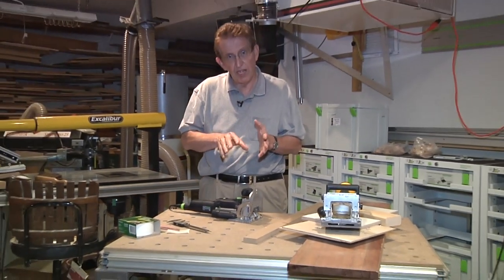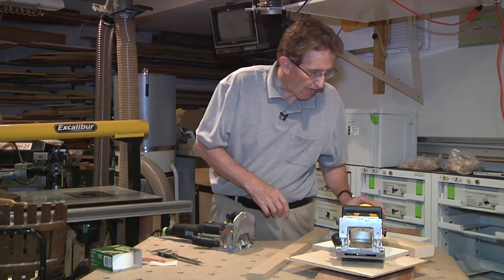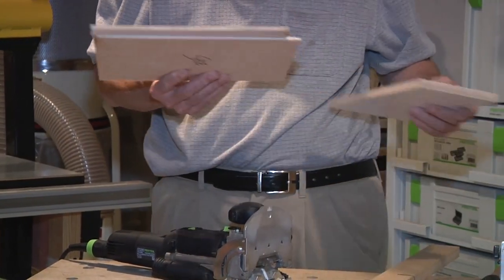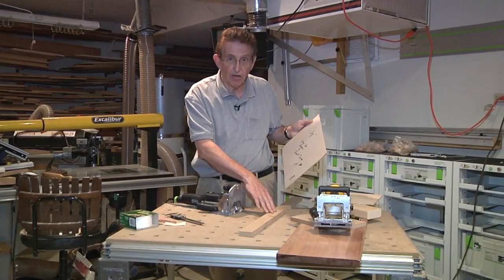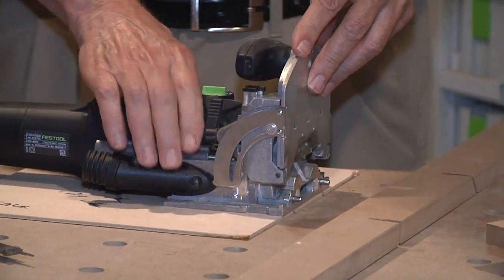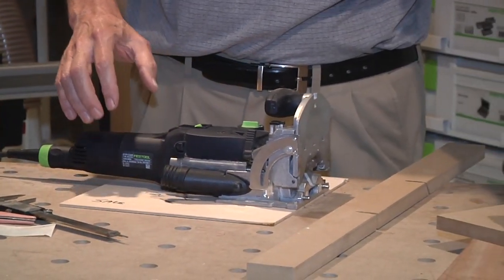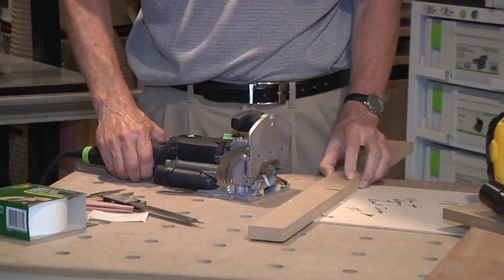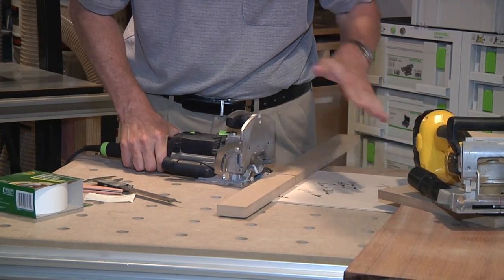Various mathematical combinations apply for various sizes of bits. What if things aren't perfect and you need to have the machine or work a little bit higher? How about having some shims available? I've got everything from 1/2 inch, 5/8 inch, 3/8 inch, and 3/16 inch available, and even an 1/8 inch. If I need to be offset, I can do one of two things: I can raise the machine by laying it onto the shimmed area or spacer. If I want to do a lot of these, I might cut the spacer to the very same size, use double stick tape and put it down. That same double stick tape technique can work right here. Alternatively, if I need to elevate the work, I can insert the spacer down to the table using double stick tape and work like that on either machine. So that changes your elevation.